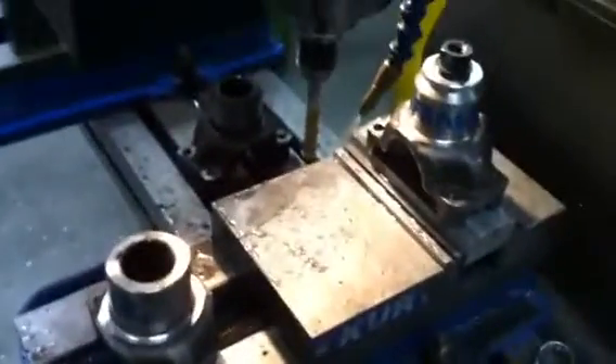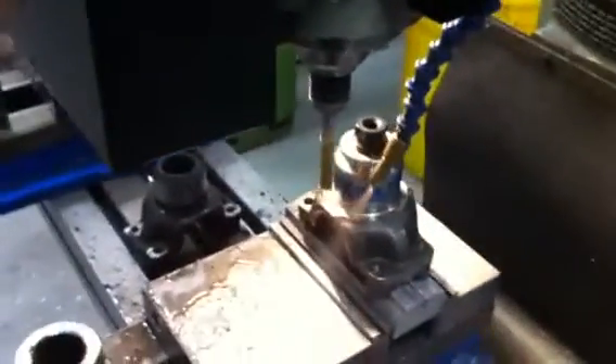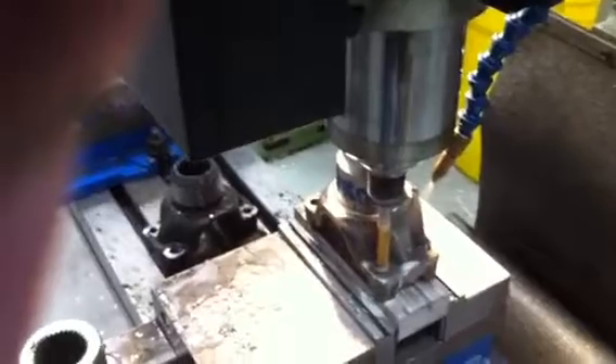You can see this is just about to finish up. I don't have a lot of travel in the Z on this machine, so I have to program around it so I don't run the tool into the part. I have a dummy hole programmed out of the way because it goes as the crow flies from point to point, so we have to plan around that. Now it's just going to keep cutting the parts — drilling holes and then interpolating a flat spot for a nut. Thanks for watching.